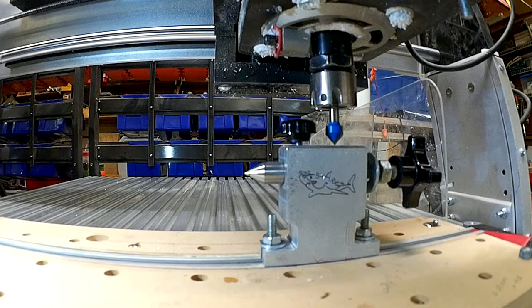That Z height is your tailstock offset. So record that number down. Okay? Record that number down. Mine happens to be 6.6. Okay? Now that's my tailstock, and 2.020 is my headstock offset. Okay? So, at this point in time, I have all the dimensions that I need to set the software up so that everybody's in the same plane.